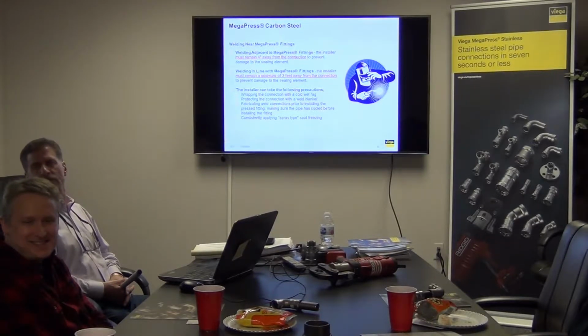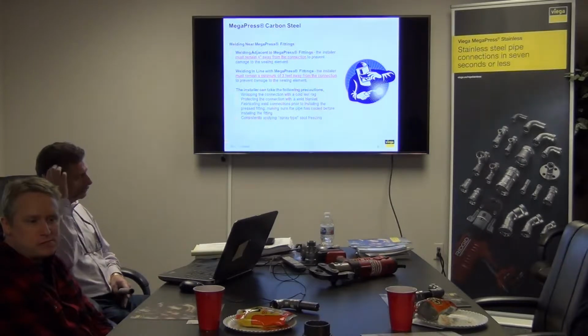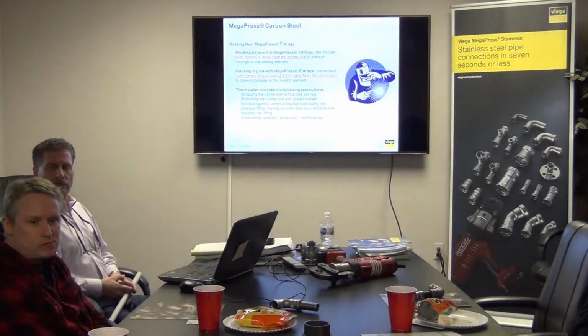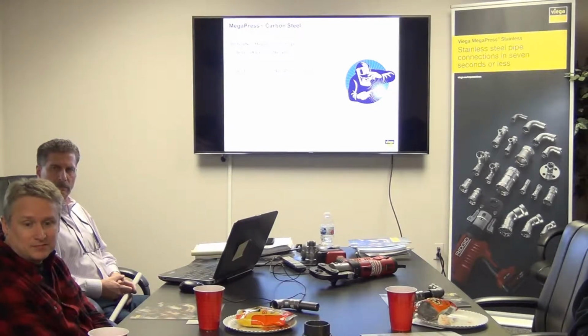So you don't see the metric anywhere else then, other than the cruise ships? That's basically, let me see, that is all I have seen. Okay. There's a company up in the New England area that handles a lot of that business, Worldwide Metrics. So if ever we needed that, I would ask you to call them, price in the cost of the jaw, let's call it $100 for a 1-inch metric jaw. Sell it to your end user, buy the fittings from them, they have them in stock, and you're going to use standard metric pipe, and all the installation procedures and application data is the same.